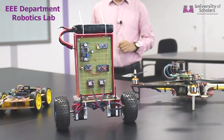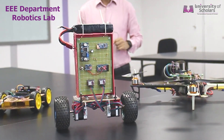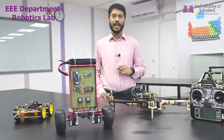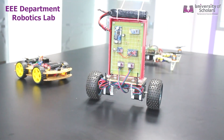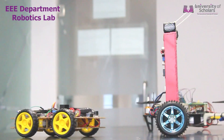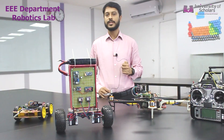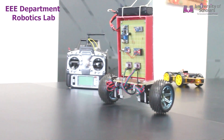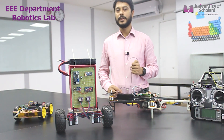In contrast to a lot of other self-balancing robots, this one uses stepper motors instead of regular DC motors. The main reason for this lies in the fact that stepper motors offer more precision and have almost no performance loss when the battery voltage drops down. One pulse is always an exact amount of motion. Regular DC motors can have mechanical friction and electrical resistance differences which can cause performance differences as a result. Robots made out of DC motors are not seen to be moving in a straight line. This phenomenon is not visible in stepper motors, and hence it is better to use them for this purpose.